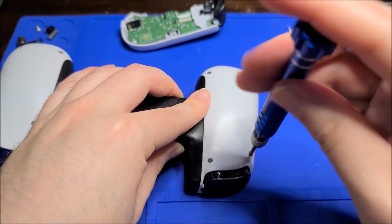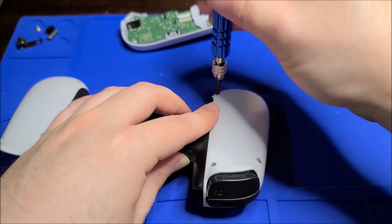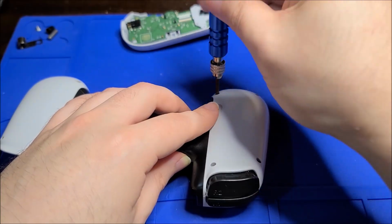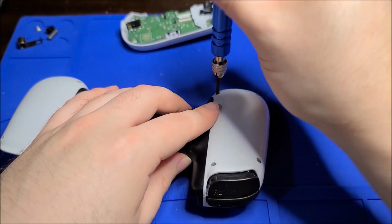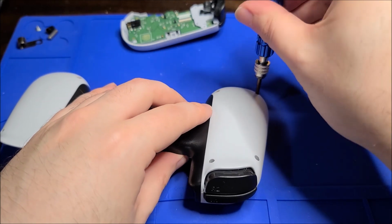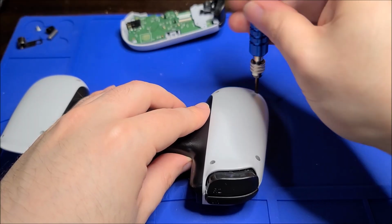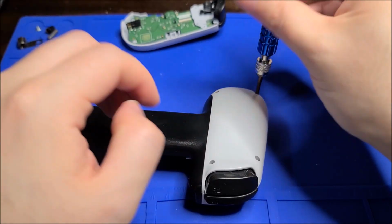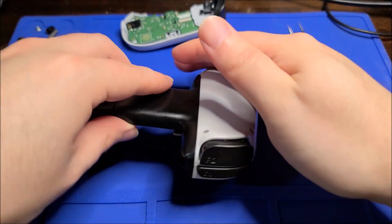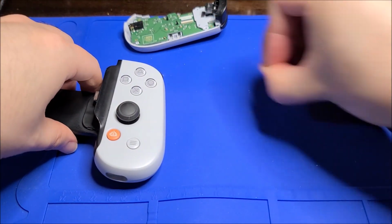Then I can just replace it with a brand new one and maybe reinforce it a little better so it doesn't break in the exact same way again. Because I have a feeling, from what I've been reading about everyone complaining about having the exact same issue, that this is sort of a design flaw. You can't use these types of flat flex ribbon in this type of folding mechanism, at least with this type of tight curvature.